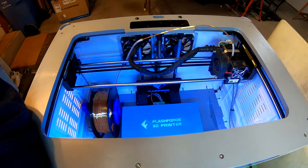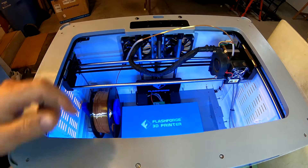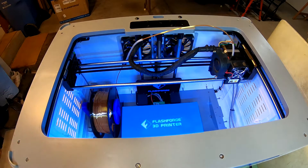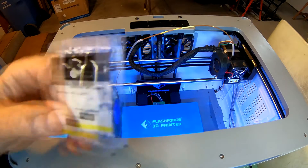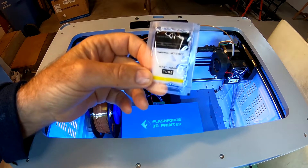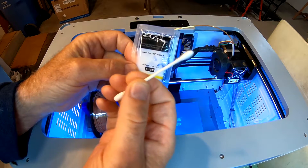I've had the Flash Forge about a month now, and sometimes when the bed is moving up and down and the head's moving, there's a lot of squeaking. I think I need to grease these poles that the different mechanisms ride on. They give you this grease with it, so we're going to try to put that on. We'll use some Q-tips and then try to wipe off some of it so it doesn't get too messy.